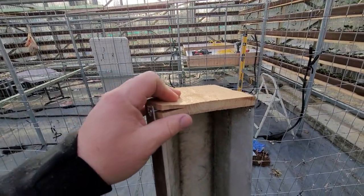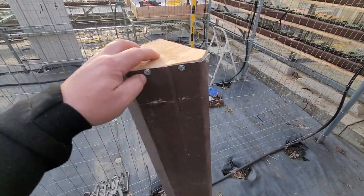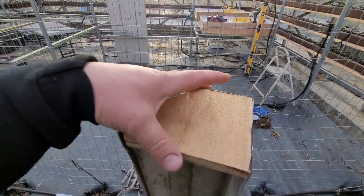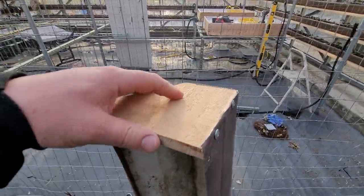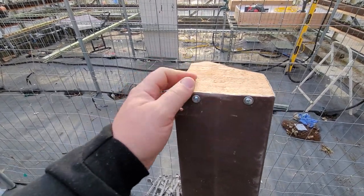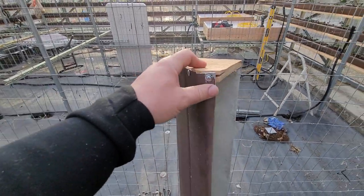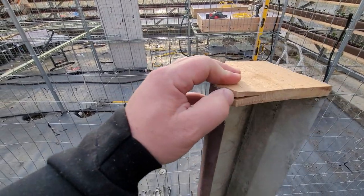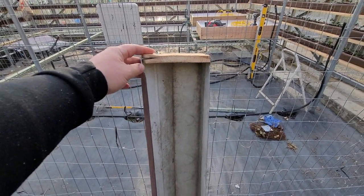It's a five-eighths fence board — just set up a chop saw and cut a bunch of these. It goes very quick if you have a template. Cut them all to length first, then cut the angle, so it goes really fast. I just slide them in and these self-tappers go right through the metal pretty easily, so assembly is very simple and quick. Cut it to whatever length you need.